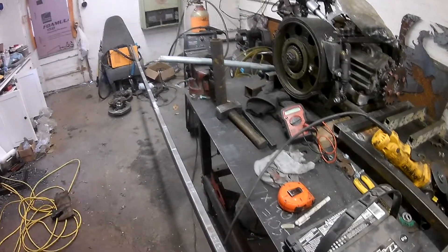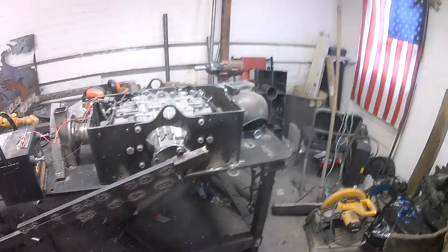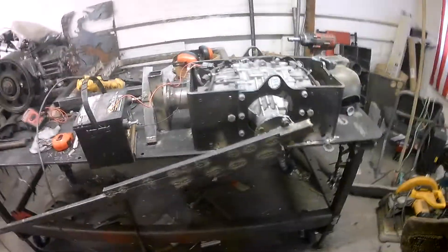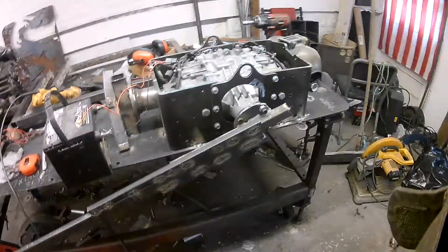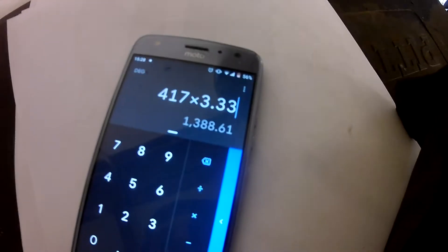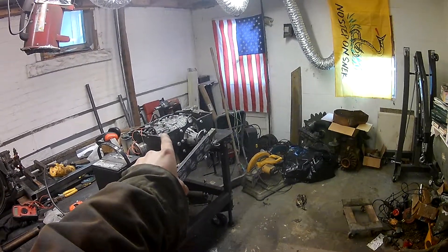What we'll do is de-energize the coil here — you can see this thing just drop off. I hope this information was useful because it sure helped me figure out if this thing was actually going to hold up. It's a lot less torque than I was thinking compared to if you just calculated out the torque of the entire vehicle from the internet. It's always good to test in real life rather than armchair theorizing. So: 417 pound-feet of input and 1,388 pound-feet of output — Acura MDX rear differential, 2007 to 2014, with the planetary setup.